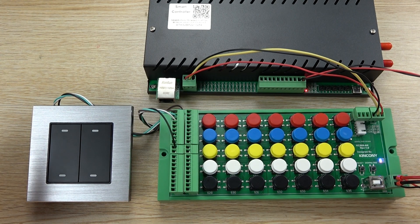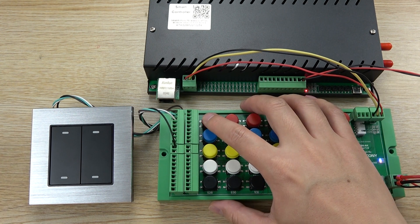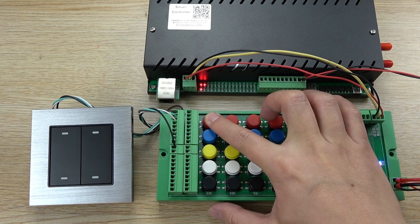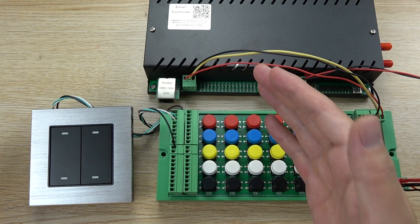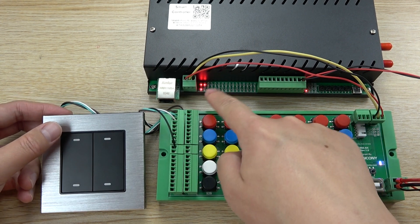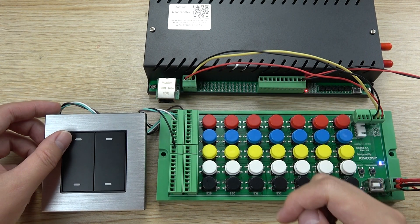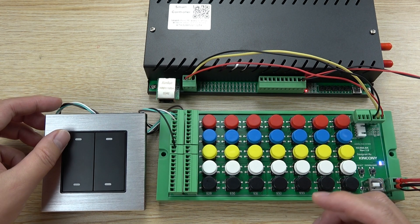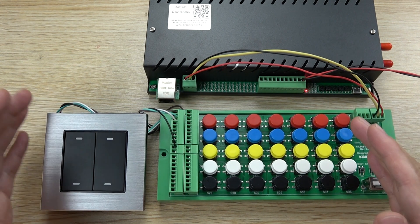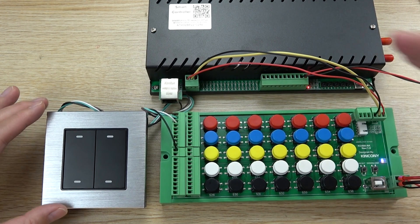Let's test it after reboot. Button 1 single click toggles relay 1. When I double click, you can see 3 relays all turn on. Hold on turns the 3 relays off. So these 3 actions all use just 1 button. You can also change the hold-on time — the default is 1 second, but you can change it to 5 seconds, 10 seconds, or any value. You can define every button with different actions using single click, double click, and hold on. This is the switch terminal board with programmable functions for the H32B Pro and King Kong relay controllers. Thanks for watching.